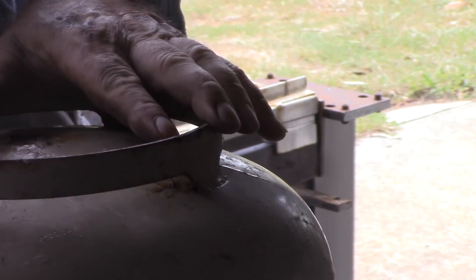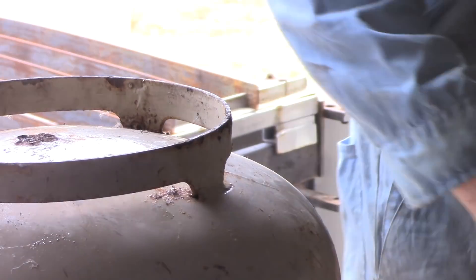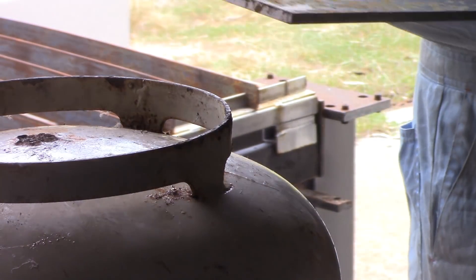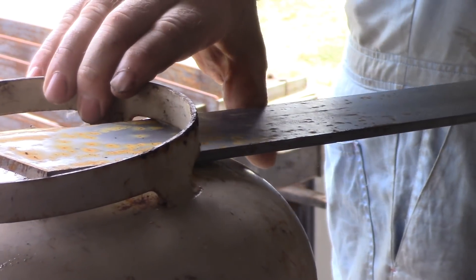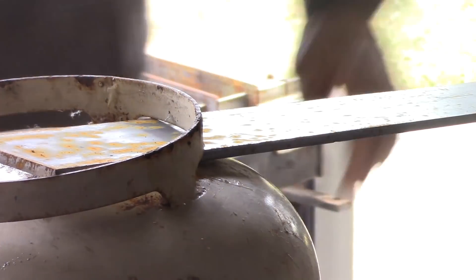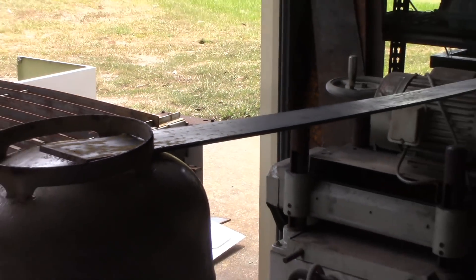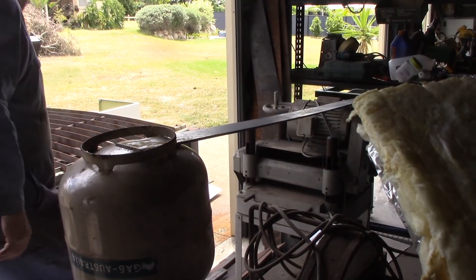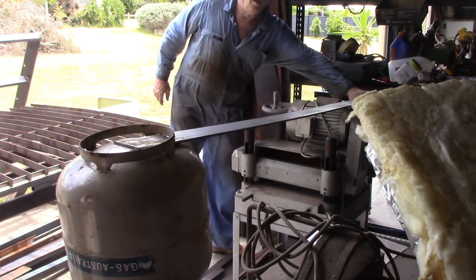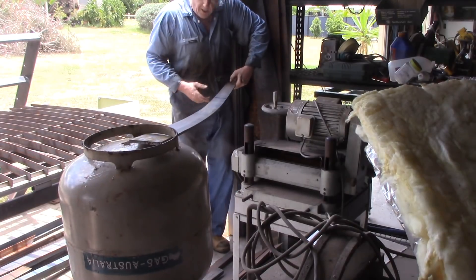Here's the plan now. We're going to put it in this vice here, do the vice up to hold it, and a fellow called Archimedes — a Greek mathematician — said, give me a lever long enough and I will shift the world, and that's exactly what I'm going to do. Not shift the world, but I'm going to shift this thing. You can see that big long lever I've got jammed in there now. I get on the end of that and it makes fairly easy work of it, because I've got a six-foot long lever to work with.